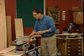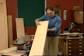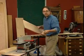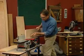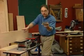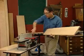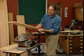The other thing, when you're working with boards and you have a rough edge, sight down the edge. And there is one thing that people make a mistake on with a jointer, they focus their attention in the wrong place. When I'm feeding this board through like that, I want to use a good push block to securely hold the flat of the board to the fence that's square to the table. That will give me a perfect edge.